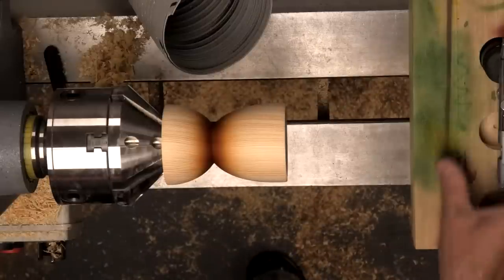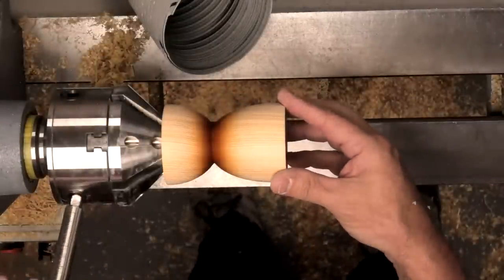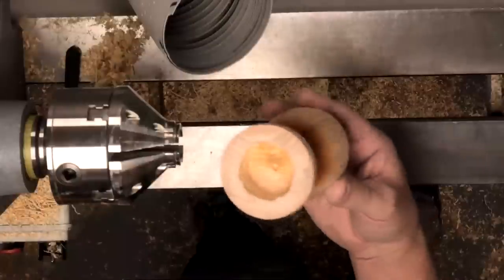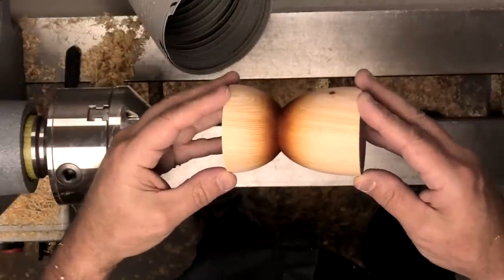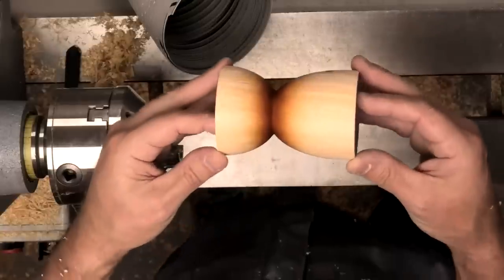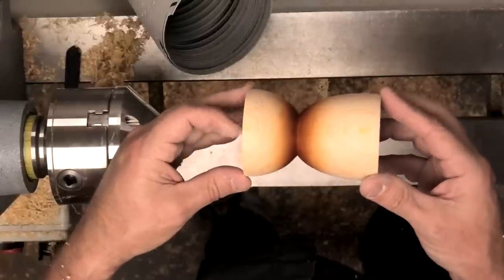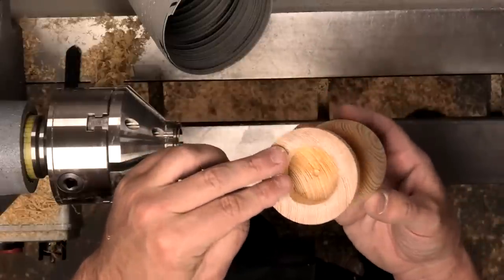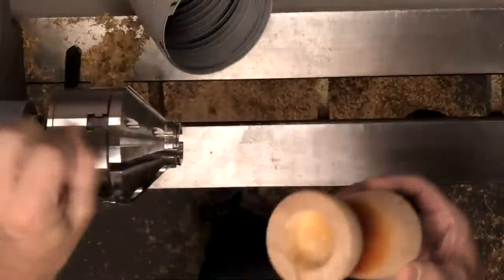Go back in its block. Now, over the top of that, it would come off the lathe. I'd wait for the stain to dry properly. It's pretty much dry. Most airbrush paint goes on dry, so you could then paint over the top of it. Because the lacquer I would use is an acrylic lacquer, I'd probably just wait an hour or so for that to properly cure, and then I can sand it and do the acrylic lacquer. Make sure it's dust free.